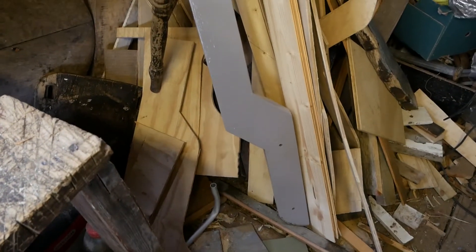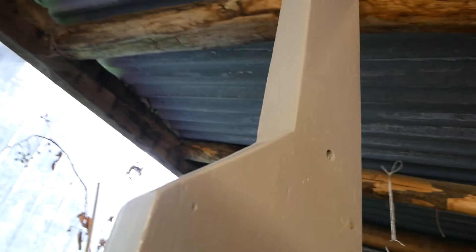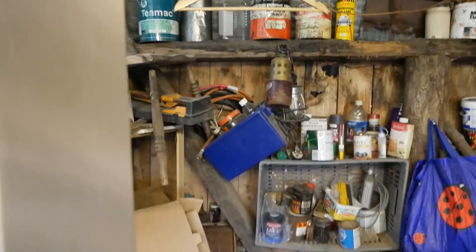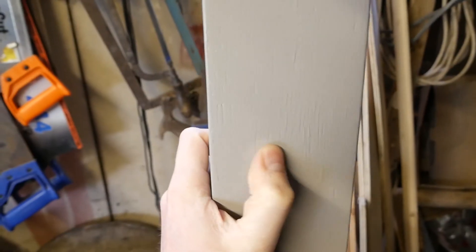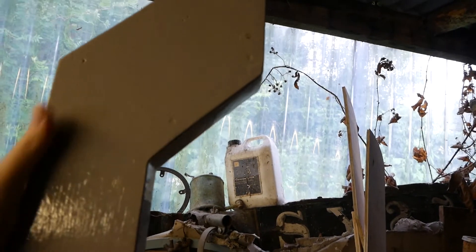Now let's take a look at the beams. As you can see, they're quite long and they have holes inside here that correspond with the holes on the hull sides, locking into place when the bolts go through. These are laminated — two layers of ply on the outside, and then two laminated one-inch-by-two-inch pieces of wood inside. So they're nice and strong, fully epoxy coated, and then painted. There are going to be three of these beams on the actual boat. They were designed on CAD, and as you can see there's a step up here that gives a nice arch and creates a proper tunnel underneath the deck, raising it a bit higher out of the water so you don't get splashed as easily. I really like the sharp design they have.